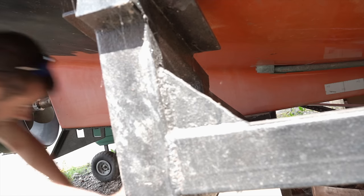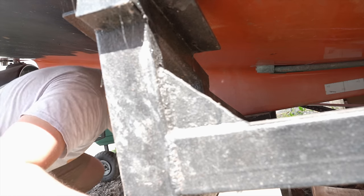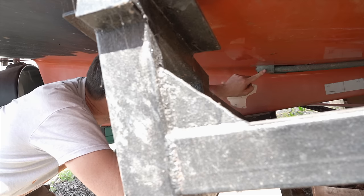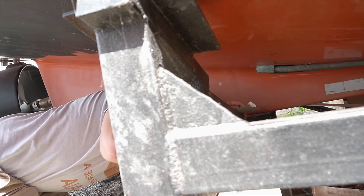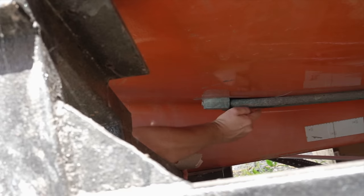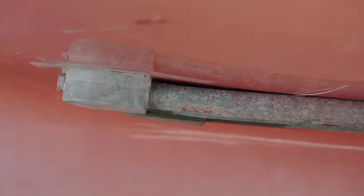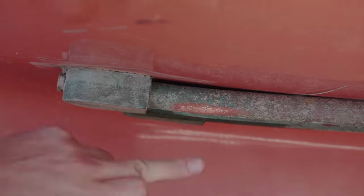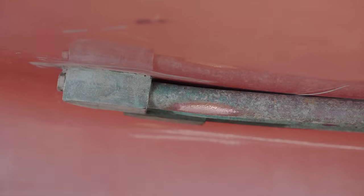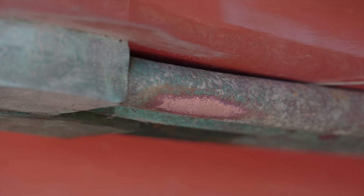We have to head outside briefly. Back in the day, plan number one was to remove this keel cooler and install a new one inside a protected conduit. Like all rubbish plan number ones, that's shelved, and instead I'm making a reinforced shield for it this coming winter. Part of that decision necessitated a check that this is a tough copper-nickel cooler, and not a softer, cheaper copper. Sanding back through the protective oxidation layer reveals a silvery colour, so thumbs up on that count. The bare surface will return to normal after a few months.